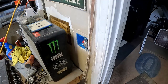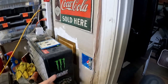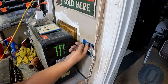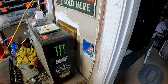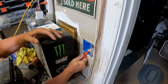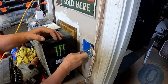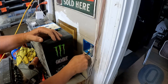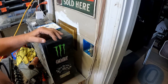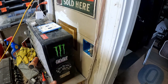You put the fish tape down, pull it out here, hook your wires up to it, then feed it through and pull your wires up to the switch. It's all open - I figured there'd be a top plate at least, maybe two plates, but it just busts out. Watch out because those legs are hot in there on one side. Use the shockproof screwdriver. There's insulation in there - that's the back side of the wall. We can use a right-angle attachment and drill a hole in the top of this plastic.